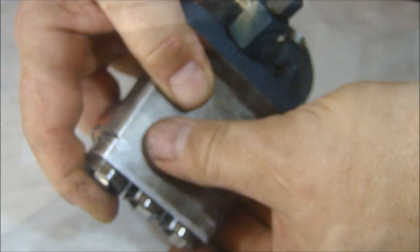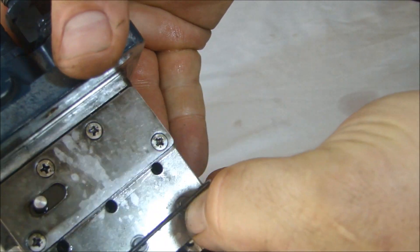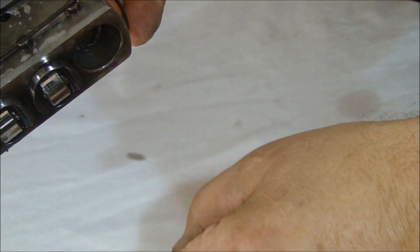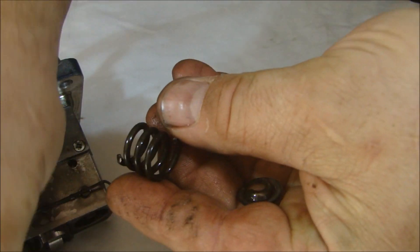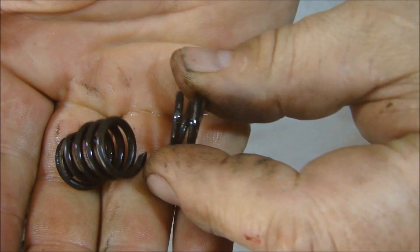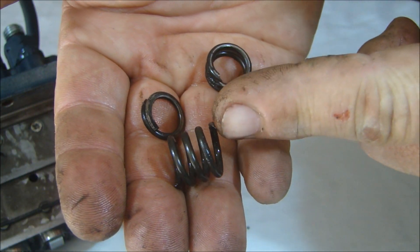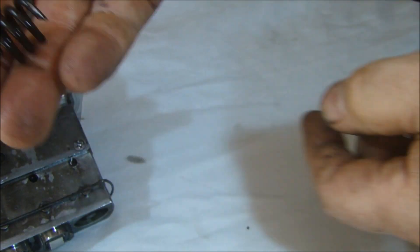Let's take a quick look inside. I'm going to release one of these clips on the side — that lifts up the detent and I can pull the lifter out. It's a roller lifter, just a little roller lifter. And there we have the culprit. So here's the culprit: a cracked spring. It's actually cracked — there's a piece inside the lifter. The spring is cracked in three places. That's why the pump wasn't pumping enough fuel — that's where it was starving the fuel. Not enough spring to return the lifter and pump fuel into the cylinder.